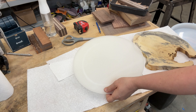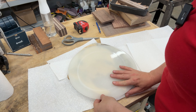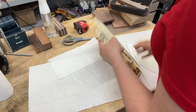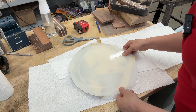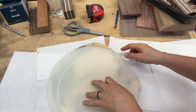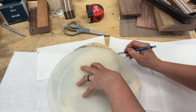I'll put my piece on the table, then place the template on top to see how much room I have. It looks like I can almost fit the whole thing if I just cut one piece over there. The other side is a little wider because it flares outward, so I need to cut a little bit from that side too. I'll take a pencil and use this template to trace exactly where I need to cut on the band saw.